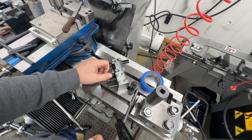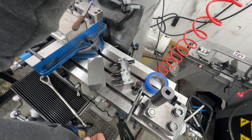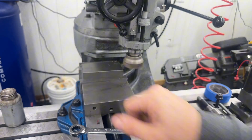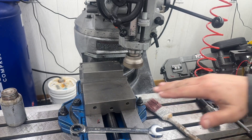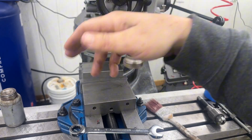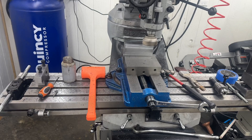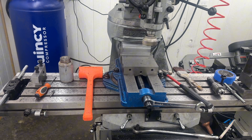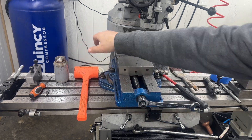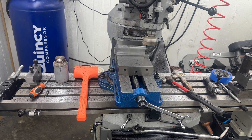So now you can see we're just cutting on the back over here. Once you get that perfectly parallel, we'll rotate it and have a parallel back surface, cut another side, and then we'll have a parallel bottom. Making our last cut — had a phone call interrupt me there. So we got the back side, the bottom, we're going to rotate it and do the last side. Got our last cut going — this should clean up all four edges.